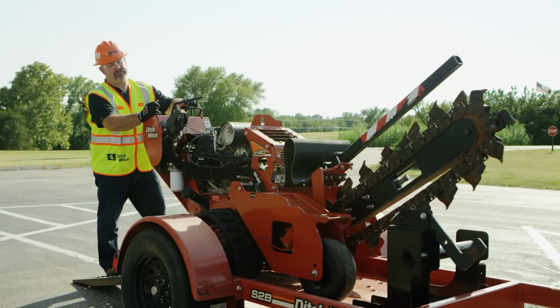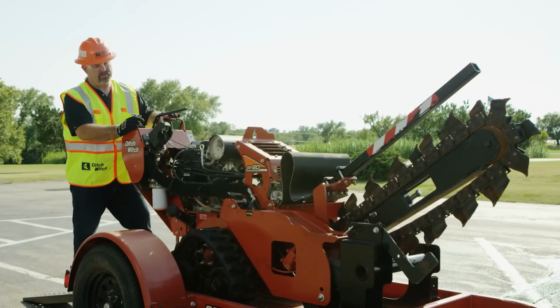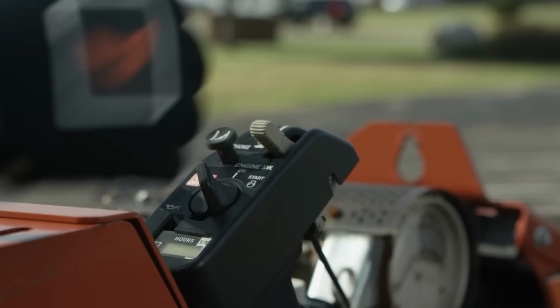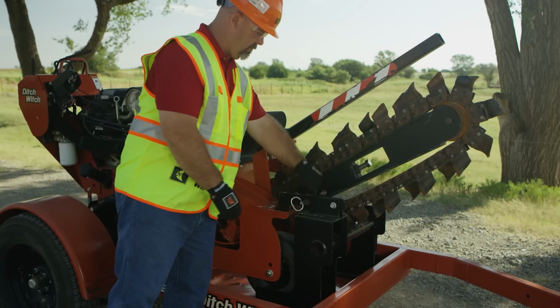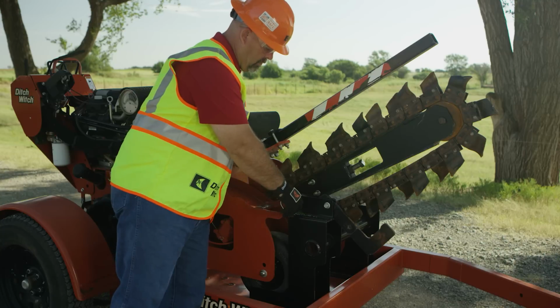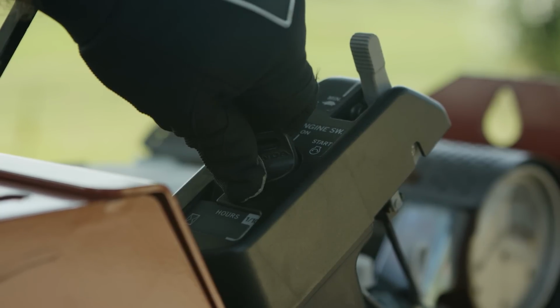On a tilt bed trailer, expect the bed to tilt. Push the boom control to lower the digging boom if space allows. Turn off the engine, close the fuel shutoff valve, and engage the park brake if equipped. To unload, first lower the ramps and/or unlatch the tilt bed. Remove the tie-downs. Start the engine.